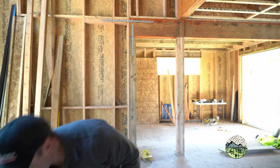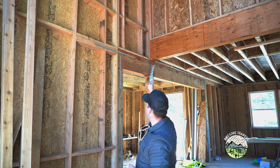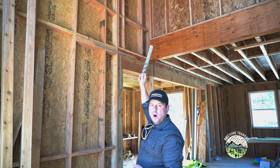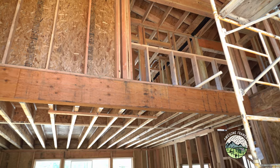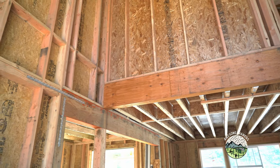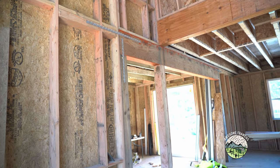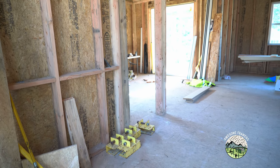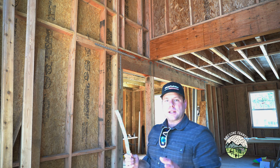Just a pair of snips and I can get the length I need. Let me show you what I mean by load path in this particular house. What you can see behind me is an LVL supporting another LVL that supports a wall that supports the ridge. The roof load above me ultimately gets transferred to this LVL, then to the next LVL, then to the columns, which are supported by framing members in the floor, which ultimately land on columns supported by big pier pads with rebar in them. So with the strap we've tied all those elements together.